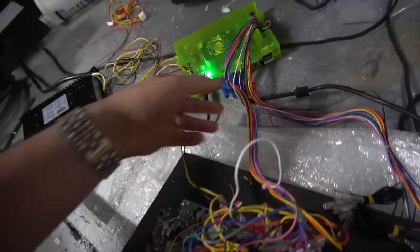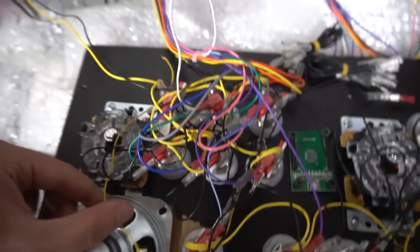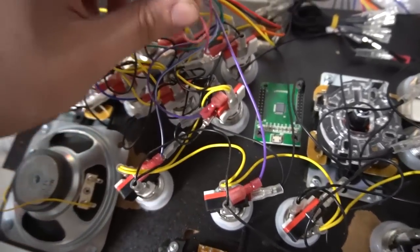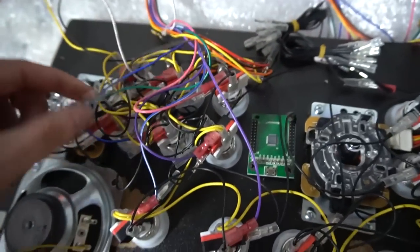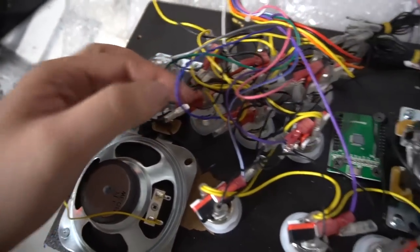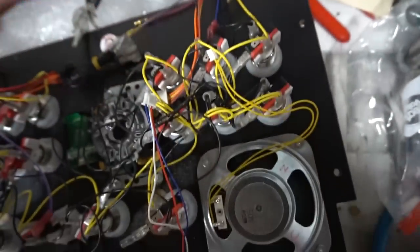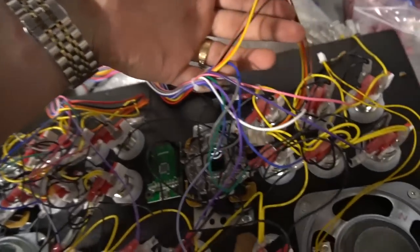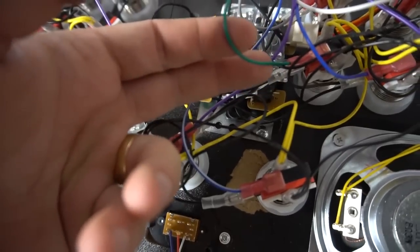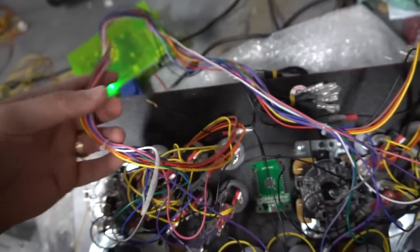While Pandora's Box reboots — check out the player one harness with all our new heads. The great thing we did is follow a consistent color code: start button is purple and white, coin button is blue and white, button A is green, button B is blue. So when doing player two, I can easily identify all the buttons within a couple of minutes. Player two is now completely wired up — button A is green, start is purple-white, just like player one. It's basically copy and paste.